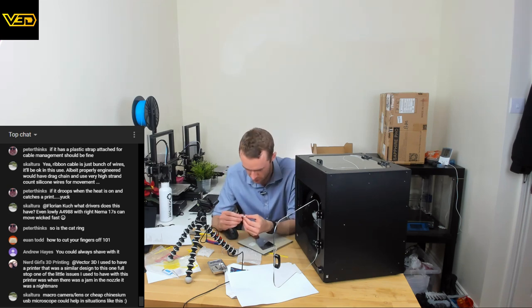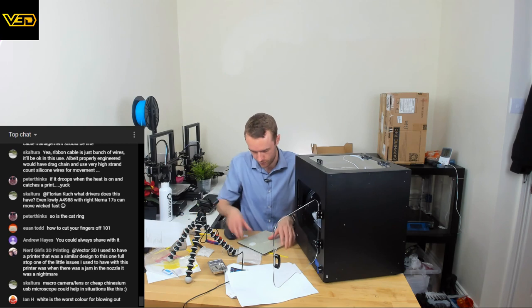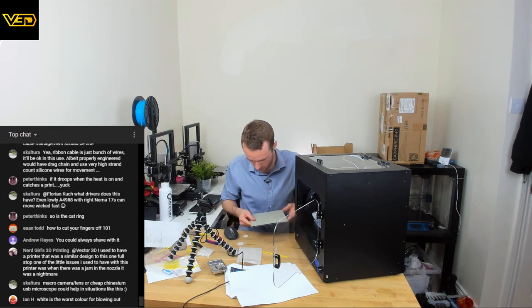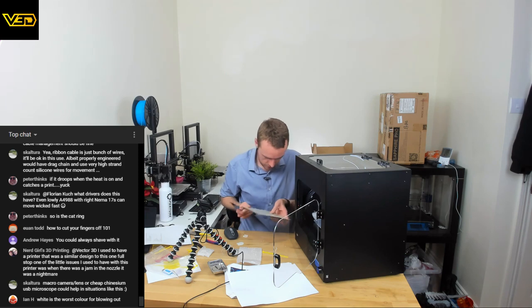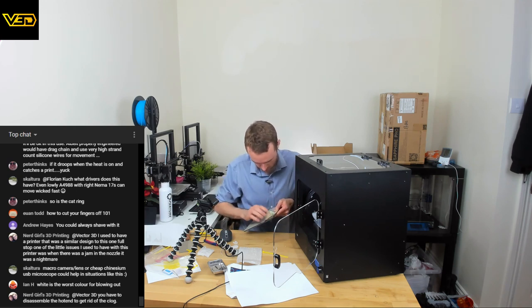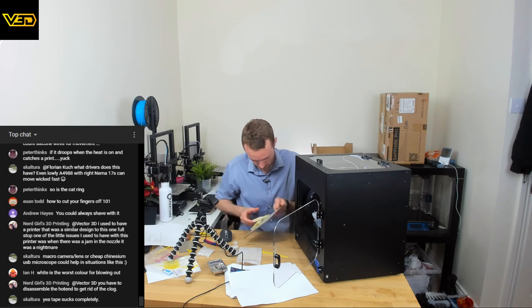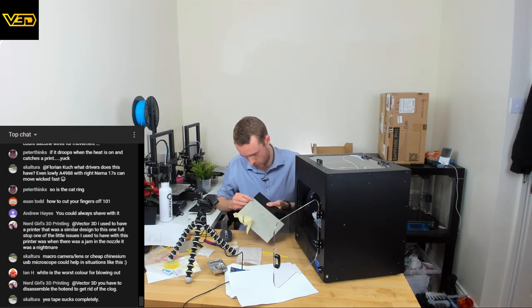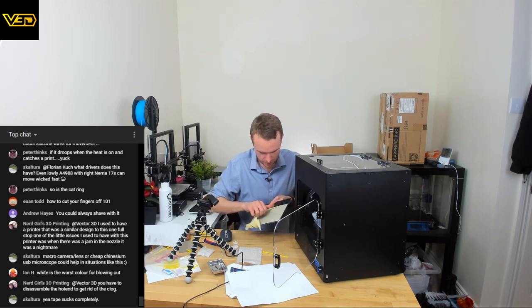Now I've got myself... Ow! Some loose bits of filament. So, got a bit more time. I mean, it's absolutely ruined the surface. I've never actually used tape as a surface, ever. For good reason, look at it. Let's just try glass, shall we? Look how nice that is. It's all like nice black. I think for doing stuff really hot, glass is generally best anyway.